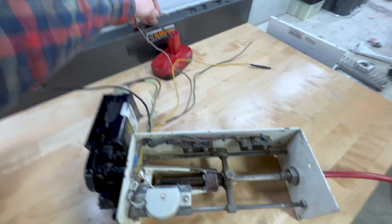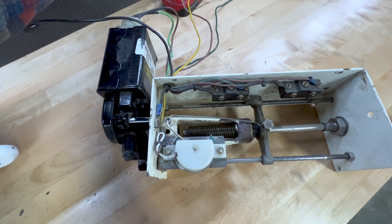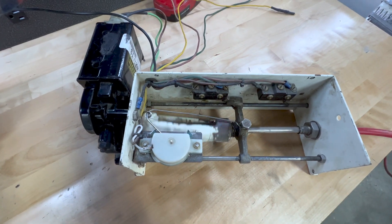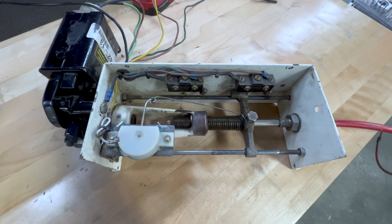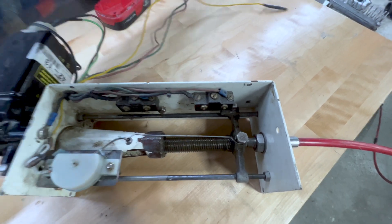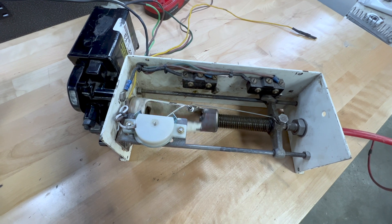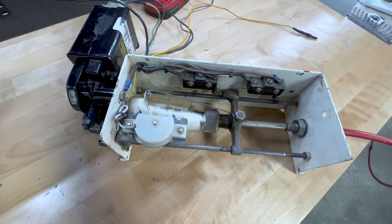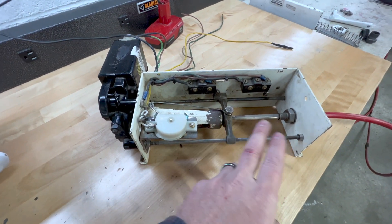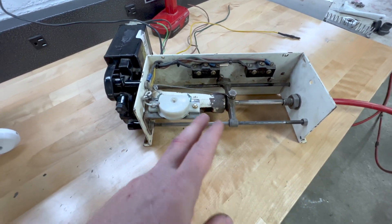I got the battery set up. We'll go ahead and power this up — you can see how this takes the spinning motion of that motor and reacts on this Bowden cable here. I'll just make contact and it runs. My limit switches are adjusted so you can hear where it clicks off, and I'll take my other wire and spin it back. The amount of time that motor ran — that is the full travel of the jetovator, taking it from either the full up or full down position to the opposite position. It's still pretty quick even though it's an older system.